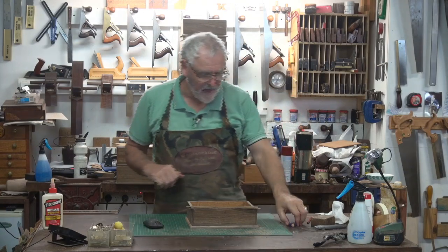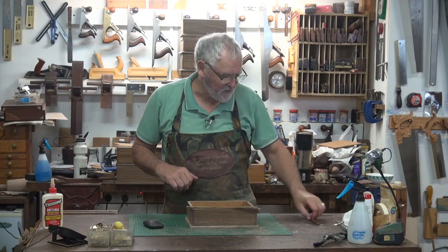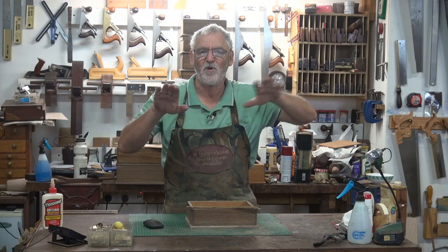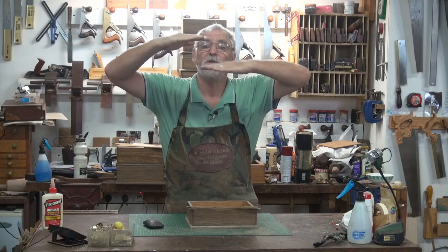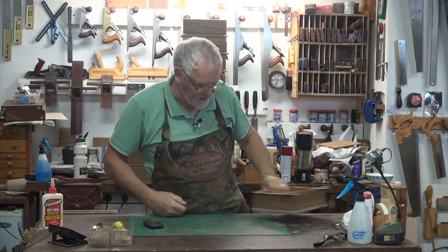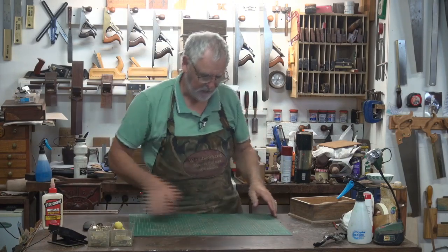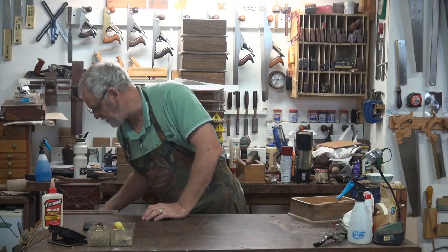With answering Prenella's question, steel wool instead of a rag. With the steel wool, it abrades the timber and pushes it in. I've done that enough. Now what I want to do is build up the oil on top. So I don't want to be cutting into it anymore. I just want to build the layers up. Because as soon as you put a layer of that, it will automatically melt and meld in with the layer below. Acrylic doesn't do that, but oils and shellacs do. There we go.